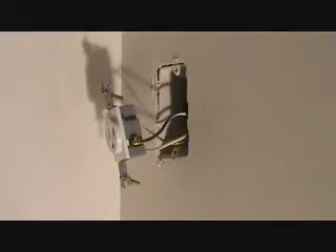Go ahead and unscrew this. This black wire is rolled over and crimped down tight. I can cut that off and rework that, or you have to get a little screwdriver in there and bend that. But I don't have to save the curly cue at the end — I can make a new one. So right here I'm going to take a pair of dykes. These are electrical wire cutters. I can get right up in there and cut that off. I'll turn this around this way and go ahead and do that right here because I've got plenty of wire to work with.